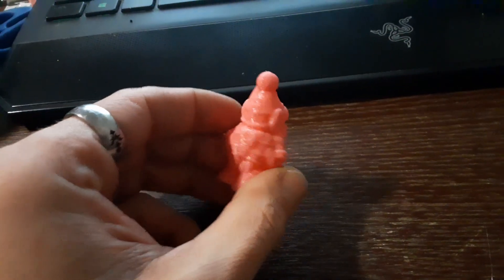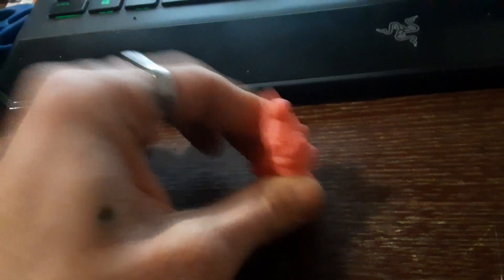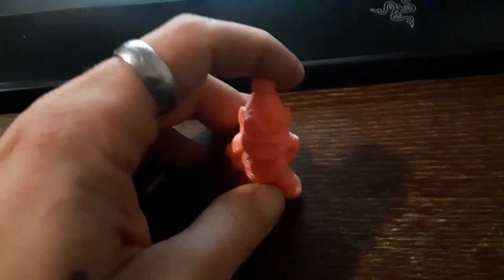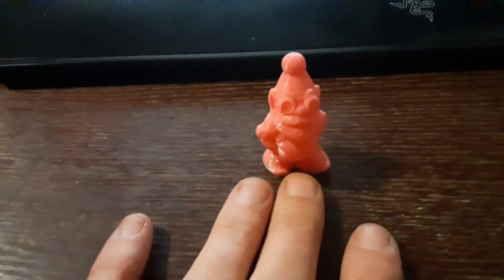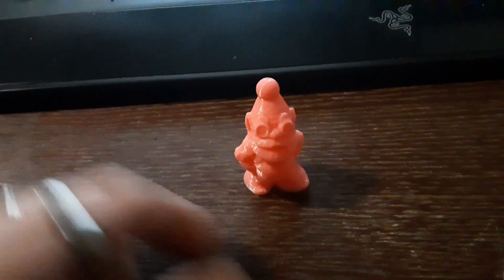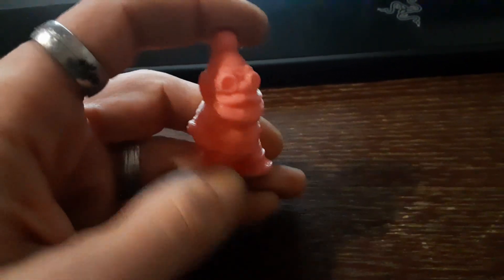Here it is — our model with zero infill. This guy came out pretty nice. You'll note you can see the layer lines because it was done at a 0.2 millimeter layer height, but it is completely empty of infill. You can hear the hollowness, and when I pick it up it is very very light compared to what you would expect from a model of this size. It's also important to note that the filament savings on a model this size when switching from infill to a thicker shell is not very substantial — it ended up being about the same weight and taking almost exactly the same time. Where this process really shines is when you're printing a larger model, because a larger model equals a larger amount of infill saved. So when printing a bigger model with this technique you will save not only time but also plenty of filament, and the models come out just fine.